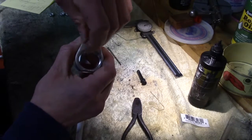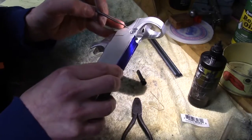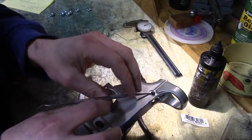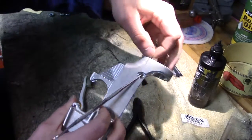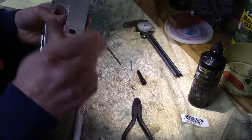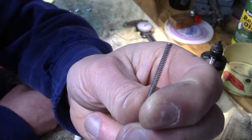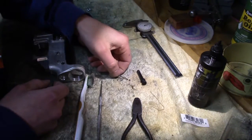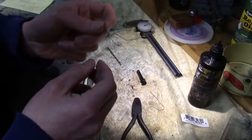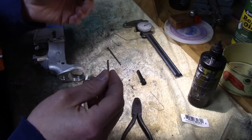Slide that out there so we can get a grip on it — grab it with our fingers, pull it out. Now, the other thing you have to do — and this is actually very important — is you have to cut the spring. Because you're going to have an extra sixteenth of an inch of material in that hole now. This is the kind of spring that when you push it in, it wants to push back out.